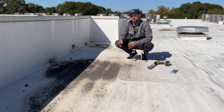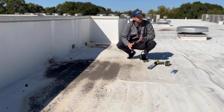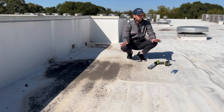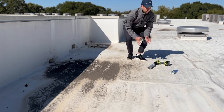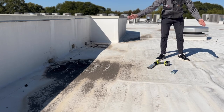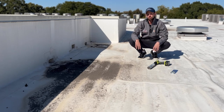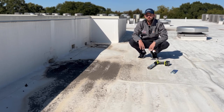The two other types of roof drainage systems that you'll commonly see: one is just roof drains. We could have a system where instead of the roof being sloped to scuppers, it's sloped to the middle or to different areas on the roof, and those areas actually have a drain. For instance, we could have a drain directly in the middle and the entire roof slopes toward it. Typically that drain goes into internal plumbing and then out of the building by the curb where all the storm sewer water needs to go.